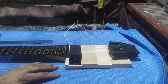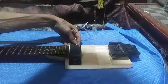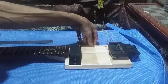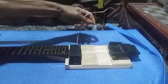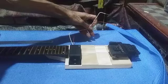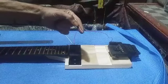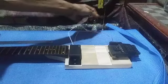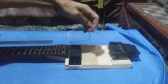And there, you don't have a whole lot of room to send it through the body. I guess you could have it come out here and come out here and then you connect them up like that. Obviously, I don't think I'm going to be preserving all of the pickup wire on these things. And this is not that hard to strip. The inside is the hot, and then this sheath here is the ground for both the power and the signal. And then this is the hot for the battery power.